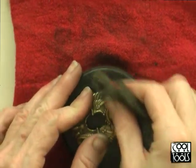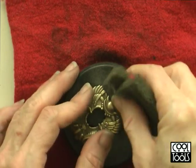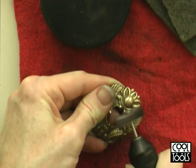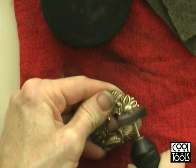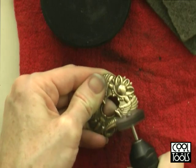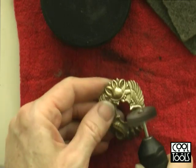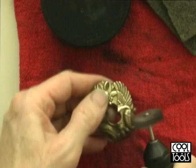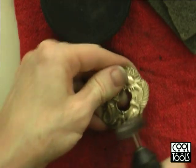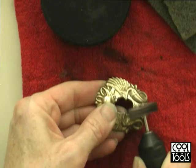In your Accent Silver instructions I've included a chart that goes over all the different abrasives that can be used on the various metals. Accent Silver will only bond to clean metal, so it's important to get the metal thoroughly clean in the places where you want to apply it. It's also important to give a satin finish to the metal rather than a high polish.